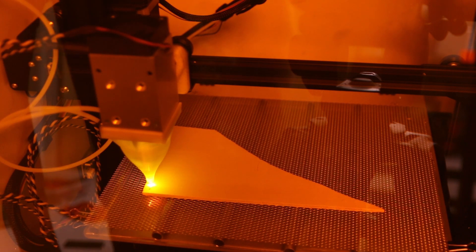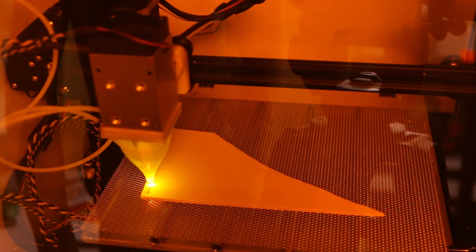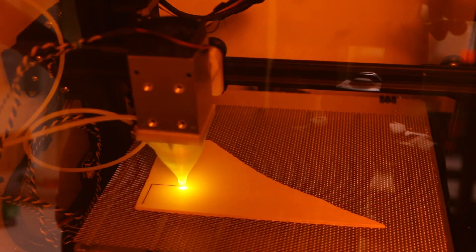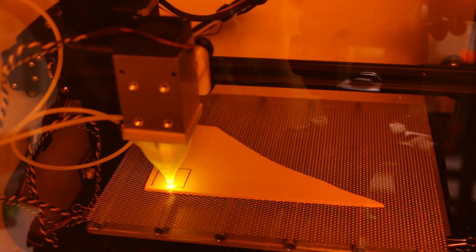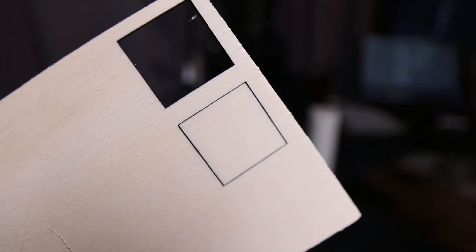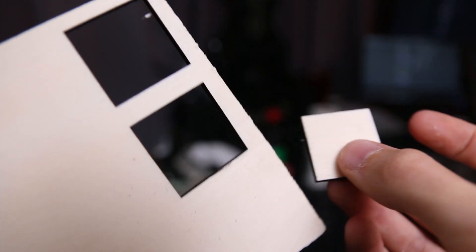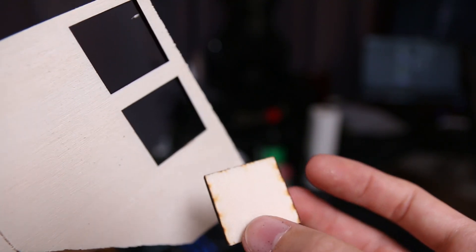That creates a clearer path for the laser, which in turn creates a cleaner cut. It can also almost increase your effective power on deeper cuts — if there's no smoke in the way the laser doesn't get blocked, so you can cut deeper and get much nicer results. Looking at parts I cut out of plywood in one pass, you can see that even without any masking tape on top, all the edges are perfectly clean without any smoke discoloration whatsoever.